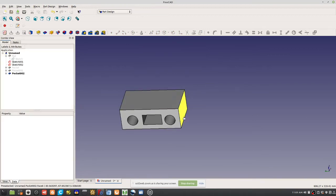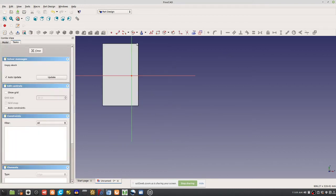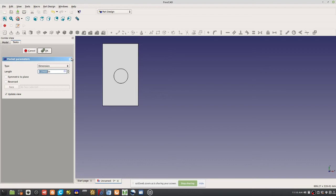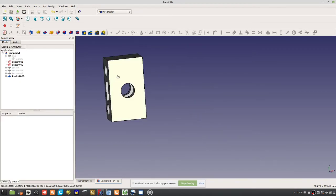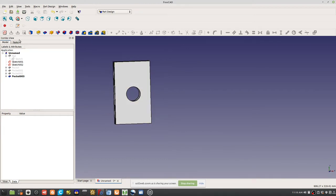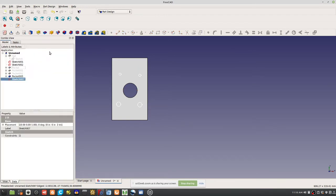What else do we need? We need to cut out for the motor, so you can punch in and get the motor shaft in there, somewhere in the middle. That's going to mount your motor. How are you going to mount the motor? With the NEMA 23 bolt pattern you can get from the CAD file in the working doc. So I'll do my bolt pattern for the motor, whatever it may be, so you can mount the motor. It's not accurate, but there you go.